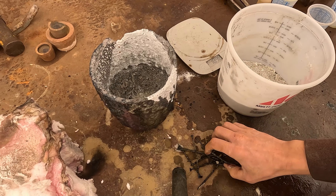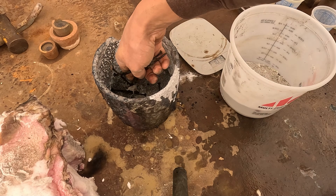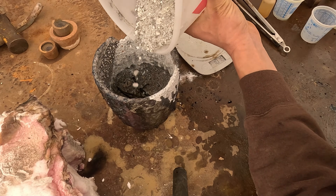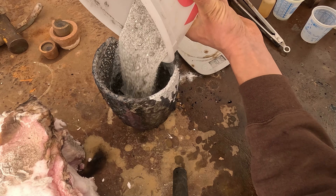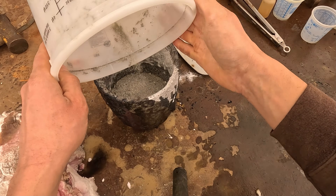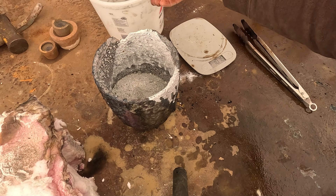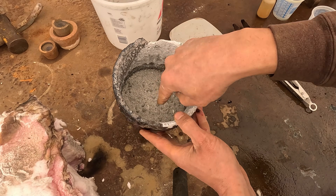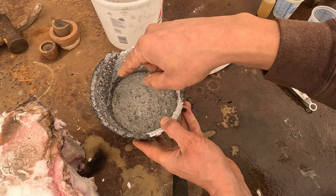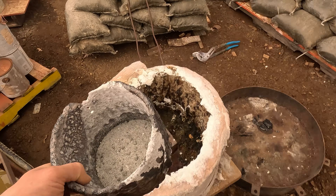I'm throwing in a bunch of iron nails — that's going to help reduce the pyrrhotite and pyrite to a form the slag can absorb, and if they get used up during the smelt I'll add more. Pouring in our charge. The bismuth will reduce from bismuth oxide to bismuth metal. You'll see little tiny silver beads of bismuth rain down through the charge, collecting all the gold and precious metals and bringing them down to the bottom, where we can collect them at the bottom of our cone mold.